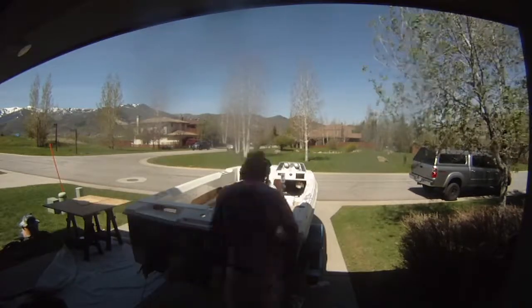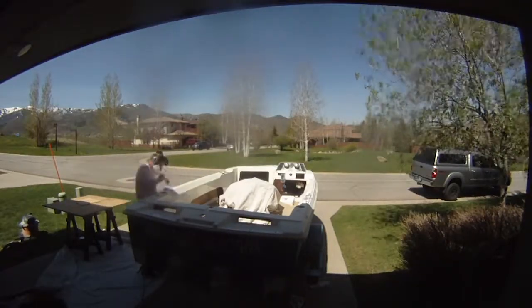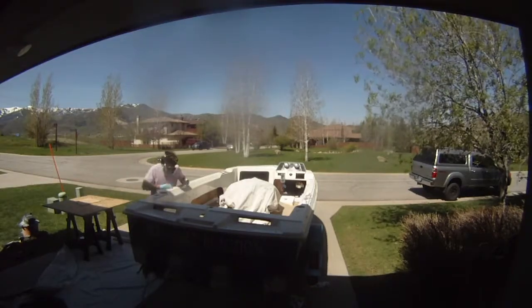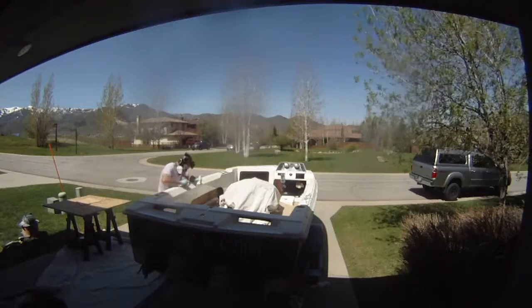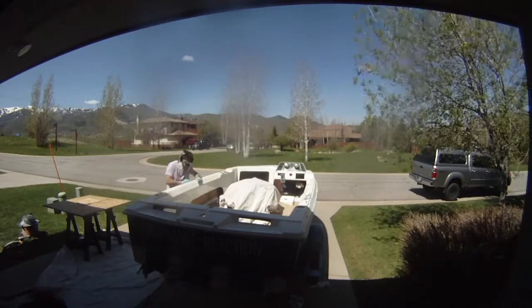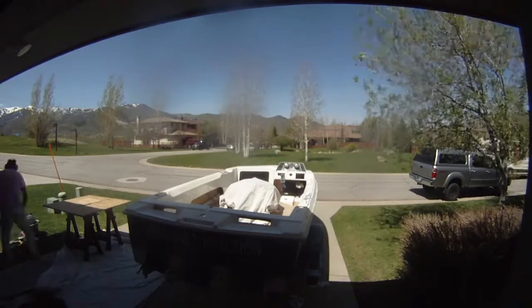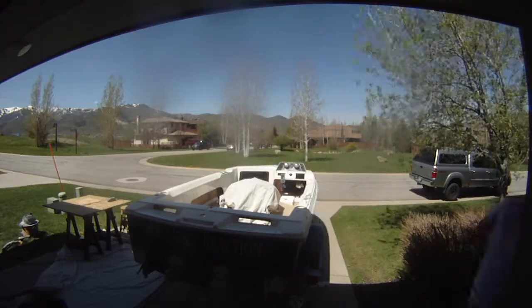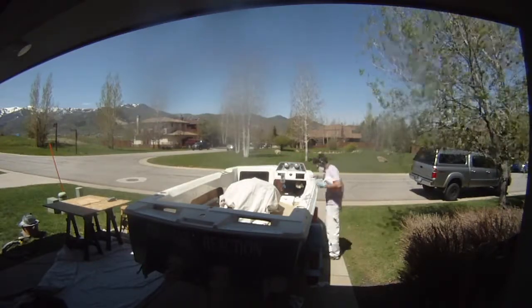Here I am transitioning to cleaning up the old holes. I poured a little acetone in a bucket, brought a paintbrush and some paper towels, and I'm working around the boat trying to clean up all of the stress cracks that I've ground out - there's a bunch of dust still inside them, so they're tough to clean. Now, I thought I had missed all this footage in the last update video and took credit for having done this in the 22 days I missed on footage. However, here it is being done right here. But that video is already edited and posted - just sticking with the theme of making mistakes and moving forward.